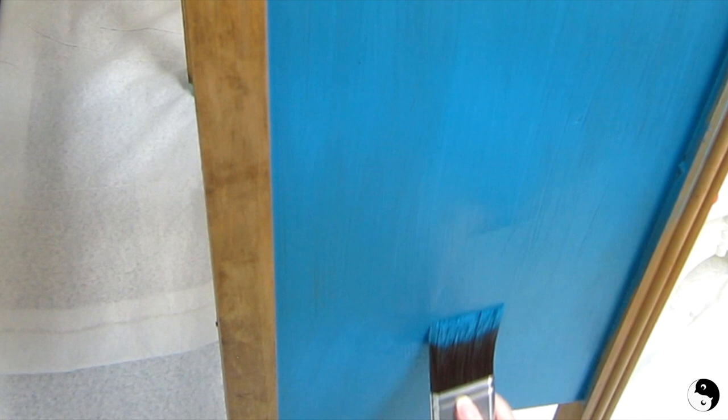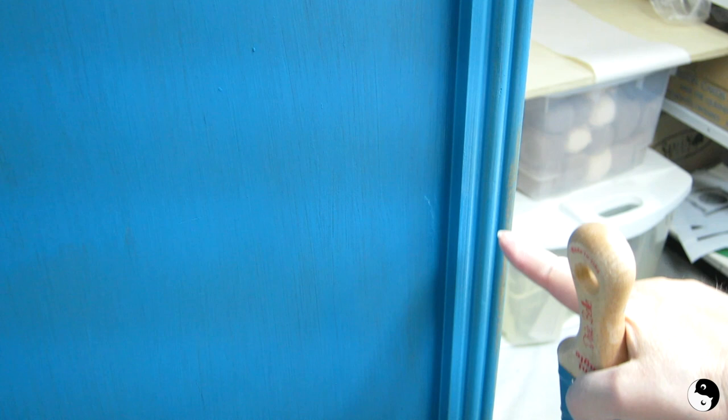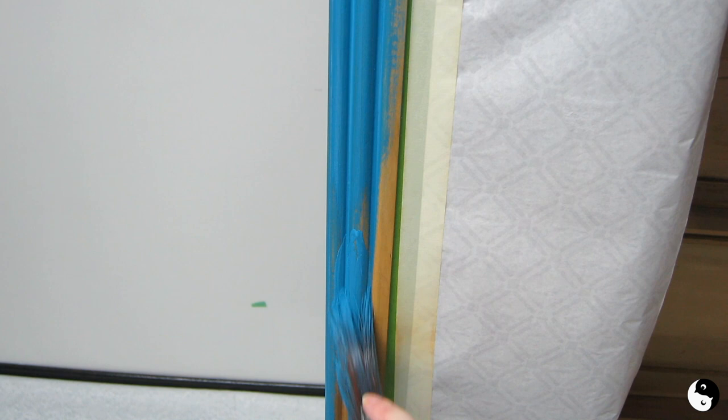It's always a work in progress. I find that when I come to the bottom here it's better to hold the paintbrush as I'm showing you here — that gives me a much better grip to come down and avoid drips off the edge. Now I'm just going to finish off this edge here and make sure I'm getting right into the corner. When you finish off, just be sure you're catching any drips occurring in these crevices before they dry, then take some long strokes down to finish.